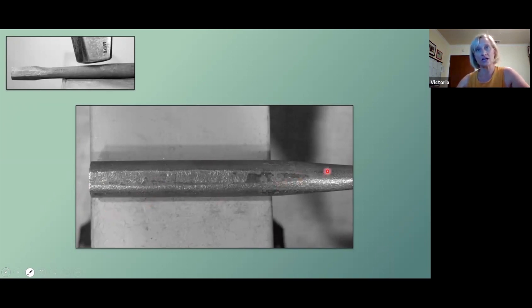So one helpful thing to do to get you started is to create flats on two sides. Don't go farther than 5/16 of an inch, just a little past 1/4 of an inch, and make sure that you're doing that on the side opposite where you want your chisel. Your chisel can be perpendicular to or parallel to your indexing. It just needs to be one or the other, not on an angle.